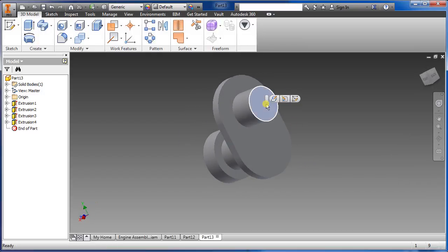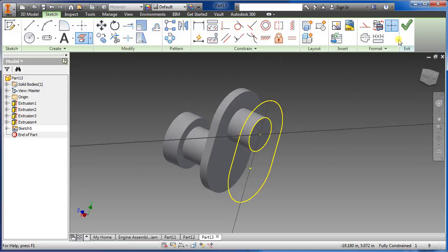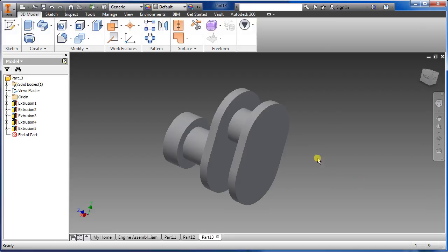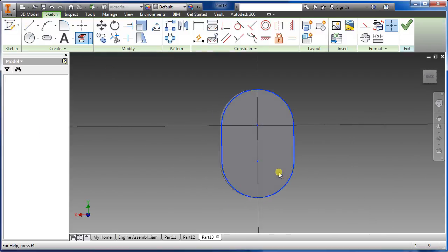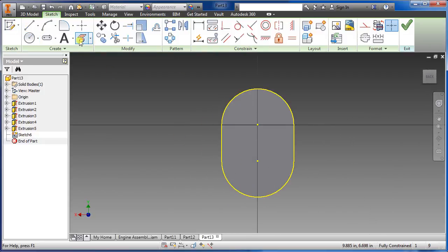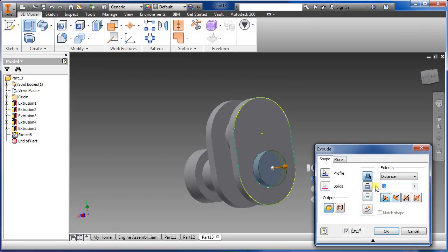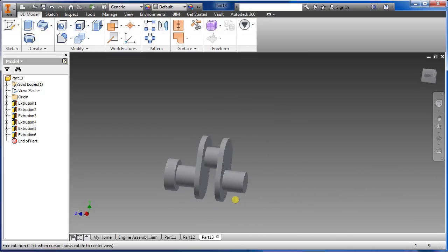Say okay. Select that face again, go into project geometry and highlight that whole thing. You can see it's already done — select extrude, select the same thing, and we want 0.5 for this, say okay. Now draw from the bottom — highlight that face, select that circle, go into project geometry, hover over until you see the small one since we're using the same dimensions. Extrude the same as before but this one we want two inches.